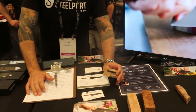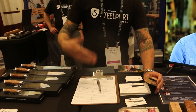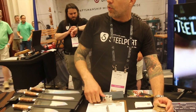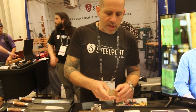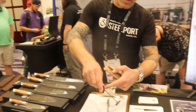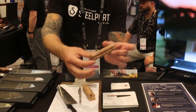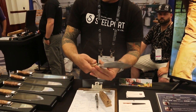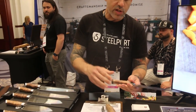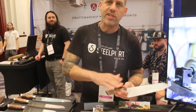One of the innovations we have to make these knives faster and better: we switched from freehand forging to drop forging, and from buffing to tumbling. We also started using CNC machines to get our tang clean, and to get our handle close to size. The slots always fit nice — no gaps, nothing to fill. We use marine-grade epoxy so it holds up to wet conditions, peen it, and then hand-sand it down to flush.